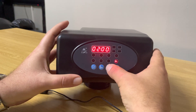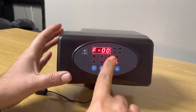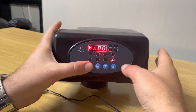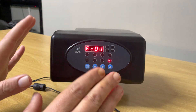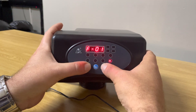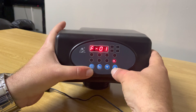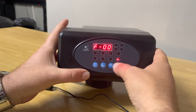We're happy with this setting, press the square button onto the next setting. This is F00 — basically you're going to leave this setting as is. There is an F01 option, but this is only for very specific applications when you actually want the head to be manually backwashed. So we're going to leave it on F00, press the square button, and it's programmed.